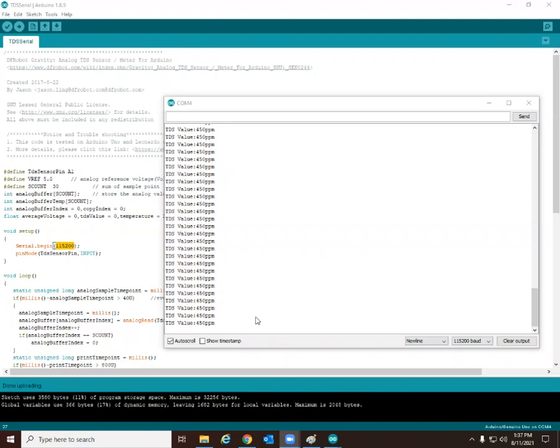Ideally, it would be. You will record those two concentrations: 100 microsiemens per centimeter or 47 parts per million dissolved solids, and 1,000 microsiemens per centimeter, which should be at 500 parts per million of total dissolved solids. And you can see that it's not exactly that. There should be a nice linear relationship between your signal and the concentration. It's very slightly nonlinear. You will have to define 3 points. You've got 2 concentrations plus the 0, and ideally it would be a linear relationship. It won't be perfect. And on that note, we are done.